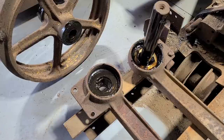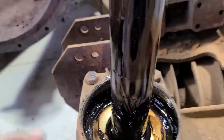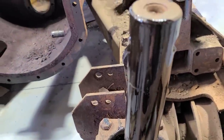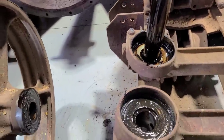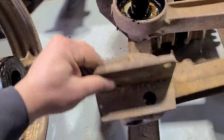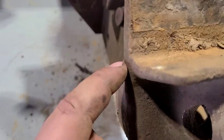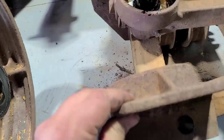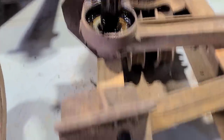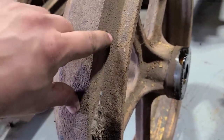I do think these would be a good candidate to build back up. I don't see anything majorly wrong internally — faces seem good, bushings are good. We have to measure those to make sure they're within spec. Even the shaft itself, although it does have some wear, that is to be expected — you're putting a lot of tension back on these. You can just catch that top wear line and then catch that bottom line. Not too bad overall. I'll have to get them cleaned up and get some measurements. Just the amount of wear in the casting is what concerns me — you can see how tall that used to be and how it tapers out, and the other side is only even worse. So we'll have to figure out if I can find some replacement arms and maybe swap this shaft and all these bushings, and then figure out what we want to do about our daylight problem in our front idler.